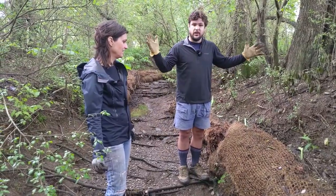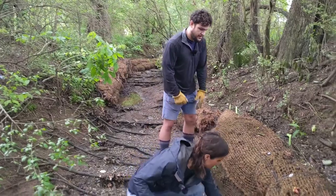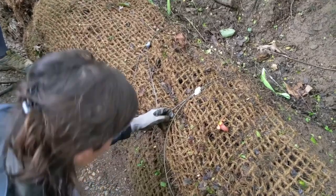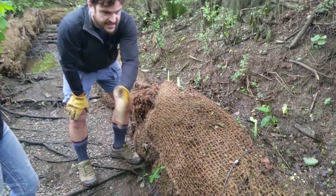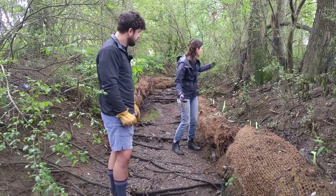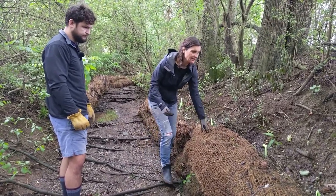Basically what we do is we take about a 10-foot long burrito-style revetment that's about 16 inches in diameter, attach it to the toe by duckbill anchors. We'll attach it to the toe with anchors and then these things called gripples — they're actually vineyard supplies. We use a mix of vineyard supplies and trapping supplies. Basically what this does is it really holds it into the bank and keeps it from pulling out. If water gets in behind these, they can start to rip off, and if one pulls away, they all can. The water is rushing down this stream off the street and the parking lot, and along the way it's eroding the bank and collecting a lot of sediment, and then it hits these spots where you've started to rebuild the bank, and it deposits the sediment.